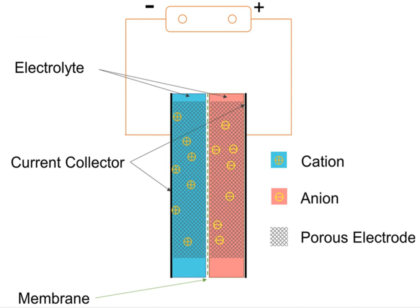No, not every material that exhibits Faradaic behavior can be used as an electrode for pseudocapacitors, such as Ni(OH)2, since it is a battery-type electrode, with nonlinear dependence on current versus voltage curve.